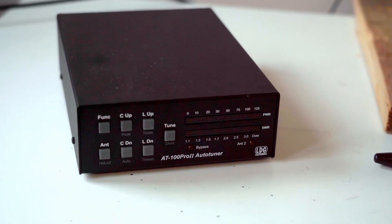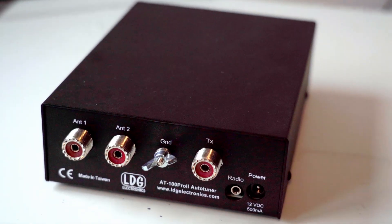You do need an antenna matching unit. If you've got an internal antenna matching unit in your transceiver, you can try it, but you may find it only works on one or two bands - you really often need something with a wider matching capability. I use the Icom IC-7300, which I've got permanently on emergency mode because that enables the antenna tuner to match a wide range of impedances. The downside is you lose half your power - only 50 watts. For an external antenna matching unit to run full power, look at the LDG range of antenna tuners - they're very good and not overly expensive.